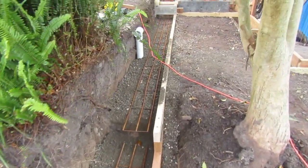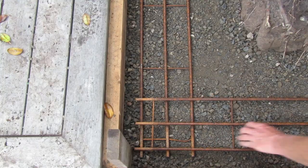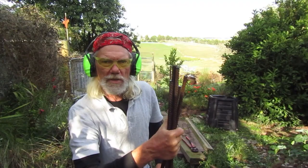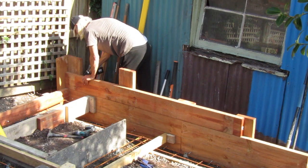To install the steel we need to reinforce the concrete in our foundations. Prepare to cut the mesh. We're ready to install them in our footings. Plastic props underneath so they sit in the middle of the concrete. Make this really solid, sticking up so the blocks go over the top of them. The block is going to align on the foundation later once the concrete's set.